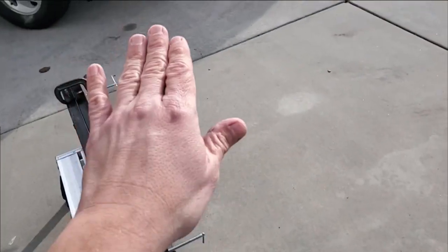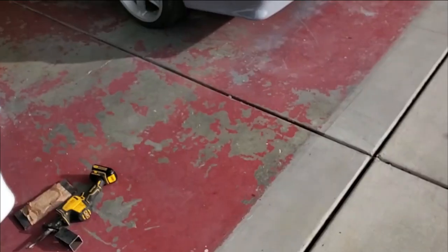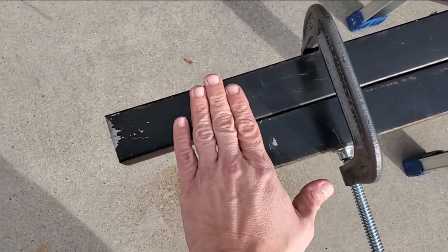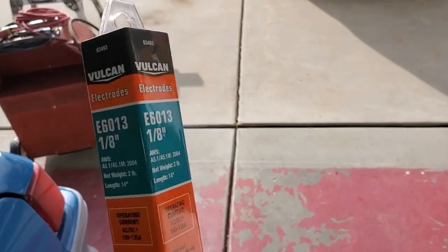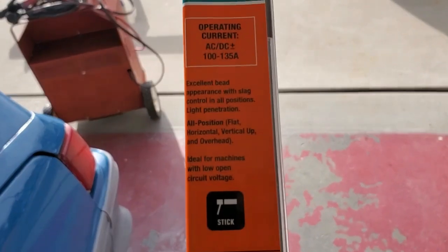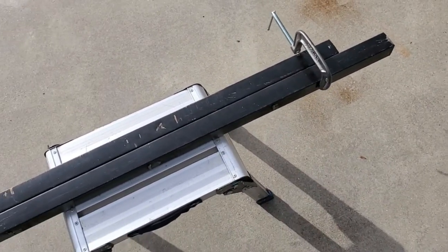The plate on the back will just have holes so if we're in a different spot and need a different height — if I'm parked over there it might not be the same height, or different tires, whatever. I'm also gonna run that up through right here so I have extra strength in this area, because this is thin wall — I measured it last night, it's two millimeter, so it's not real thick. You might ask why I'm using it — well, the price was right: free. This electrode is supposed to be pretty good for stuff that's not the greatest, not cleaned up, works okay in painted environments and rust — that's got every checkbox marked on this project.